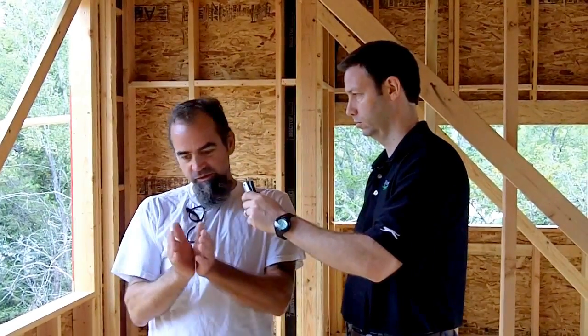Yeah. And then too, when you have a header in place that's already put together, when the sun hits it as it's already in place, it'll start to do the same thing. It wants to curl. It just dries out faster on one side than the other. From a builder's perspective, what Bill is talking about is important during the frame stage, but really comes into play big time after the air conditioning goes on in the house, or the heat gets turned on when the house is finished.